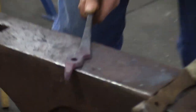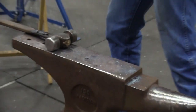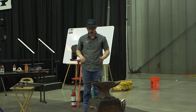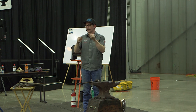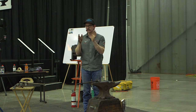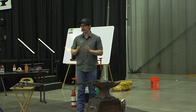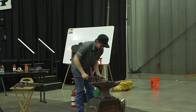I'm going to go ahead and pack both sides of this thing, because I want both sides to be real flat. And when I punched that hole, I created a mountain and a valley. And so I always want to put the mountain on the inside of the tongs. Because if you have two valleys, this is going to be a cup. That's when tongs don't operate real well. But if things are on two mountaintops, they don't have a lot of resistance and they can work really well around the fulcrum. If you took a pair of GE tongs apart, they all have a machined ridge around the rivet hole, and that's where everything's right on just those. It's not going to get real bound up on anything. It's got room to clean it out.